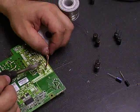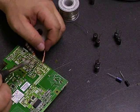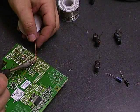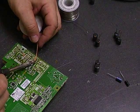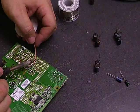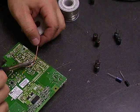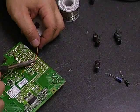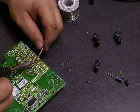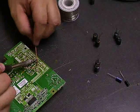While you're doing this repair, you do want to make sure that you're using the right capacitors. The capacitors need to be low ESR, which is equivalent series resistance. They also need to be high temperature and high ripple current because this is a switched mode power supply. Without using the right capacitors, it will cause stress to the power supply and you can blow out additional components if you use the wrong capacitors.